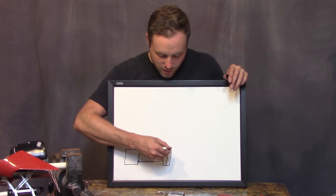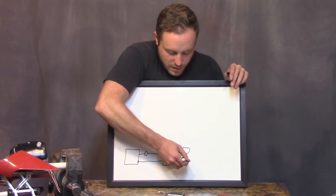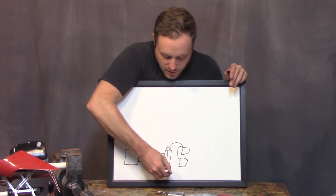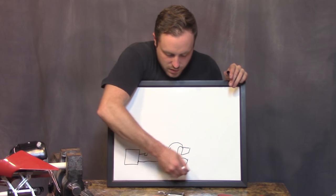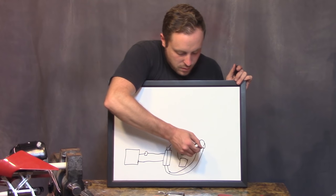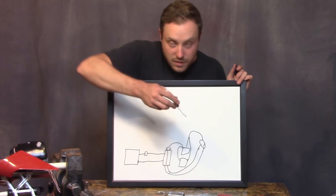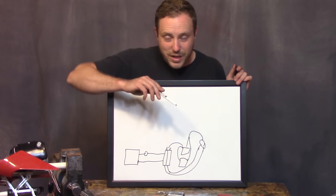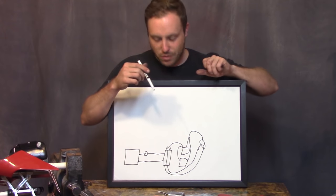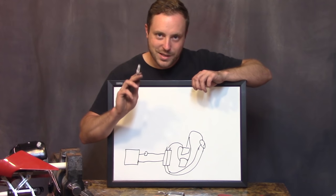So they have power wires that go to my two sets of servos — that's what powers those. Then there are signal wires. The signal wires are on a switch that changes which one sends out signal. So when you hit this switch, it makes the launcher and the arms open and close. And when those servos open, that's what hits the limit switch that keeps you from firing the rocket when it's in the down position.